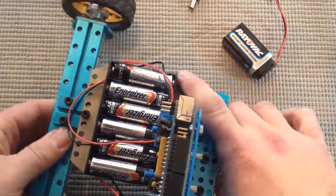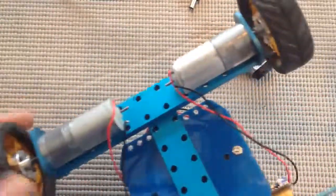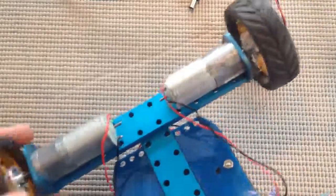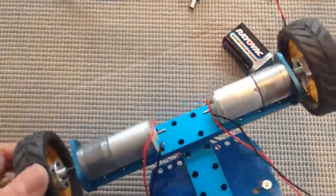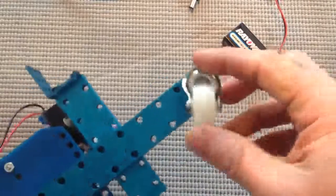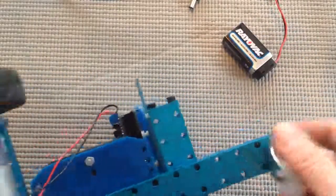So I built the robot. Let's take a look at the underside first. You've got the two motors here, and they control both the steering as well as the propulsion of the robot. If I want to turn one way, one wheel goes one way and the other wheel goes the other way, and it kind of spins around. Facilitating that on the back is just a caster — it doesn't need more than two motorized wheels.